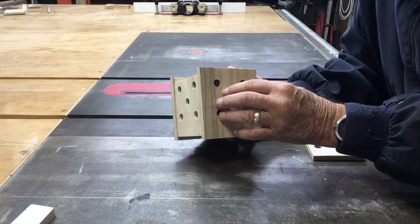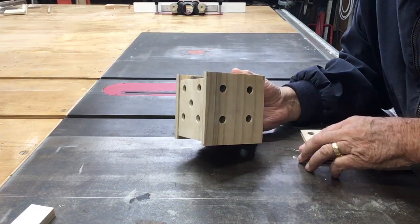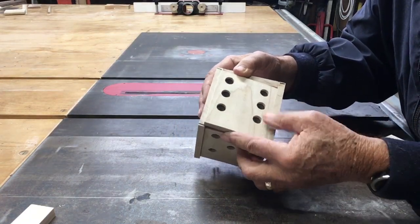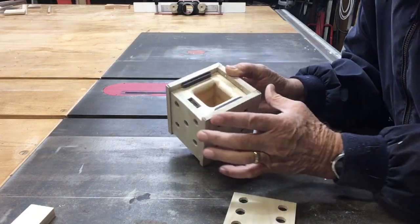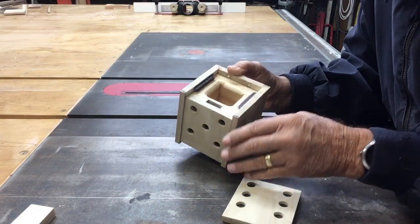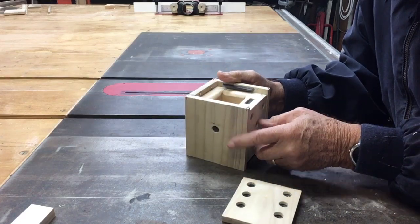So put your slide in, put your number 4 side on, use your number 6 door, lock it in your slide there, and use that to adjust your height. And don't forget to do your width, but use your door. You want it just touching the top so it slides. So after you get number 4 all done, you want to do side number 1.